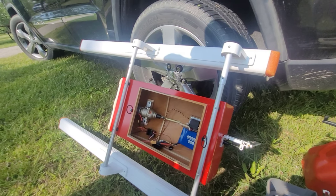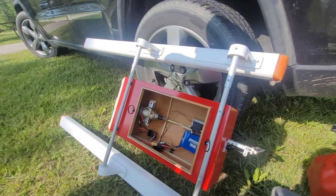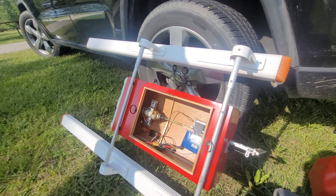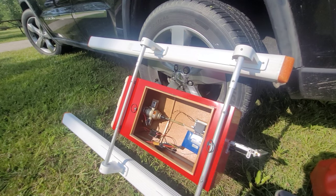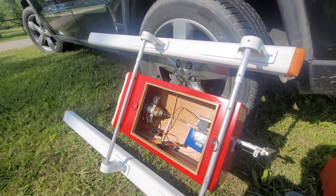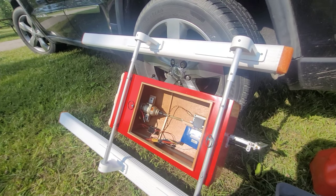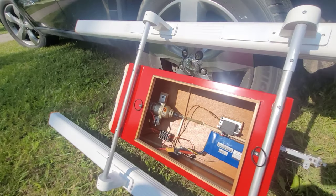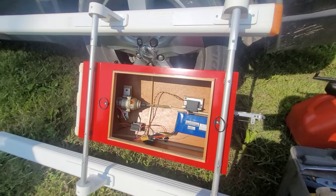How did you get this to tighten up in here, since I'm assuming it doesn't have a hex shaft? You take a worn strip driver bit, cut the end off, and weld that onto the hard part of the shaft — or on the flex. I've never had one fall out on the job. So you welded that right to the flexi part? Yes. I don't throw out broken flex shafts — I cut off the length I need and weld on the hex driver on the end. Then just plug it right into that driver.